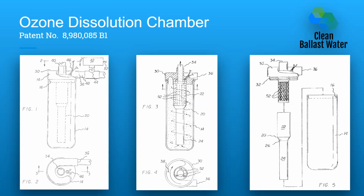Our client's technology in theory is more efficient than other ozone injectors due to the laminar stratification of these gas bubbles, meaning that the larger bubbles will remain on top of the tank until they're finally broken down. The smaller the bubble means the better the contact with particles in the water, which will mean better disinfection of the system. As water is recycled through the system, the ozone concentration will continue to increase its oxidative potential, which will increase the efficiency of the system.